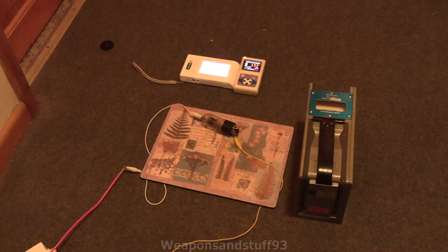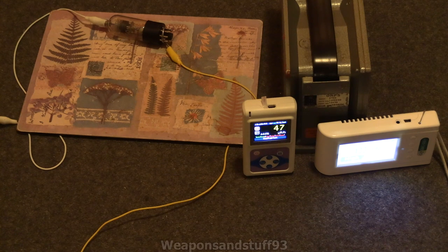We're definitely getting some more results now. We're getting to about 140 micro-roentgen on the Radioscan. I'm just going to turn the light on and reposition some of these counters slightly. A slightly new angle — let's try this. Now that's much more what I was expecting. Some of that could be due to electricity going through the power cable, but generally when you have a power surge on a Geiger due to high voltage it makes it go to several roentgen per hour, not just a bit higher in micro-roentgens. I'd say the Radioscan is definitely picking up x-rays at that angle.